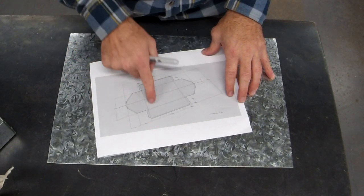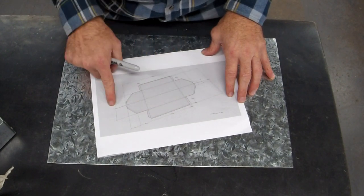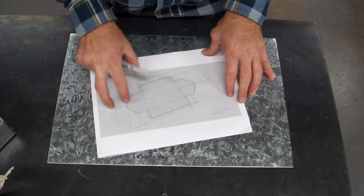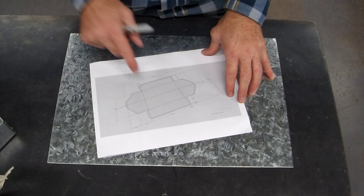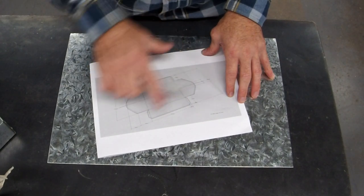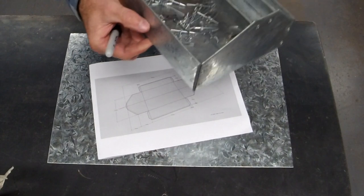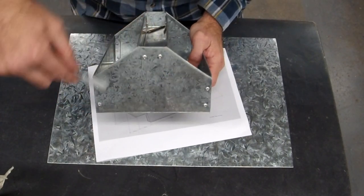It's super important that your center rectangle is 230 by 170. Please, once you've drawn that, double check it, triple check it. If you got that right, the rest of it will just fall into place. It'll be easy. But I've had too many kids in the past who have gotten this a little bit out of center, finish the whole thing, and I end up with toolboxes that have short sides, don't meet in the corners, they'll have two different ends on them.